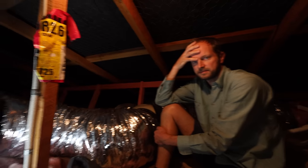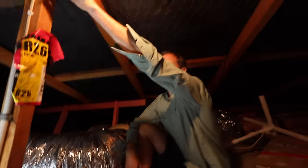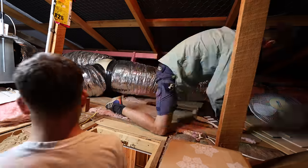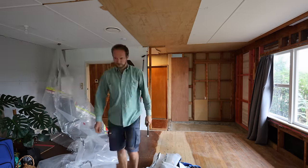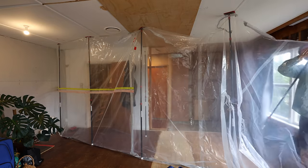We also need to support these roof struts. There's really just so much going on. Roof strut, roof strut. We've got the ridge beam here supported on two ends. In this hallway they've actually changed the direction of the ceiling joists. Rather than going from wall to beam like the big room, they're going side to side. That means we need to reframe the ceiling completely so it does the same thing the living room ceiling is doing — wall to beam.